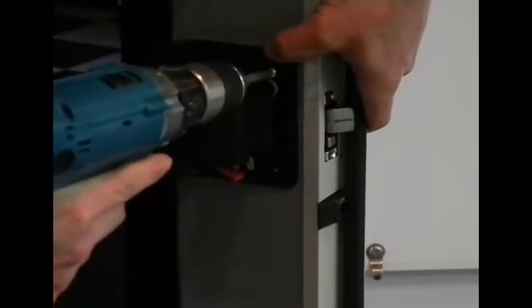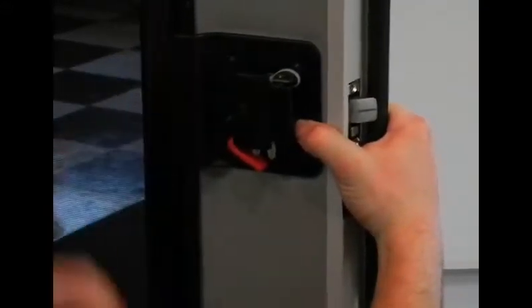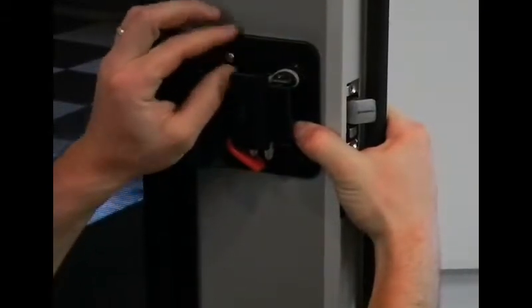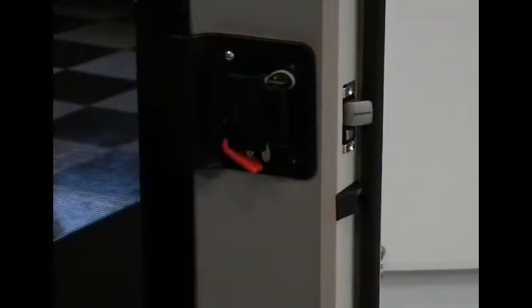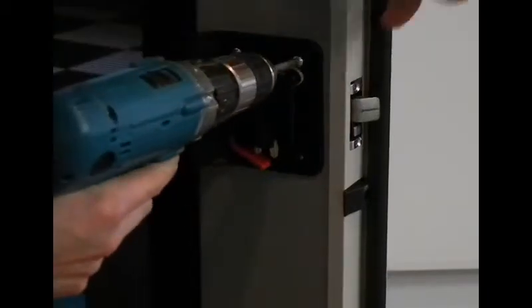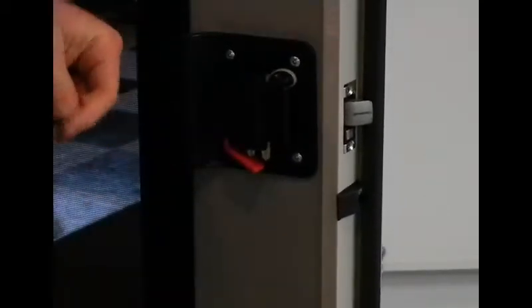If you hold the latch in place with both hands, look at it and put a screw in place, starting it with your finger. Once it's started into the outside plate, you can see where the screw goes if you look at it closely, then tighten it up. Start one screw but don't tighten it all the way — this will make it easier to line up the next screw. Do the next screw, line that one up, then the bottom screw, line that one up, and the last screw. Tighten them all up.